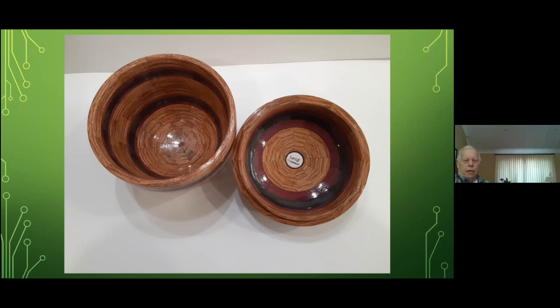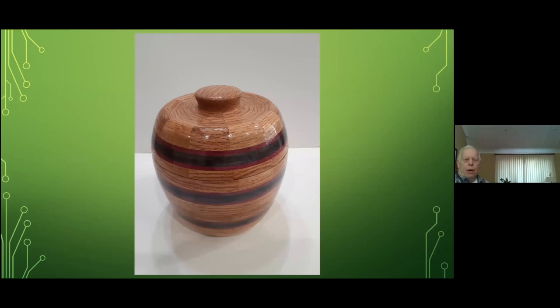And what everybody's talking about, the 13/16, it is a tight fit. So I take a parting tool and just enlarge it a touch to get the bead in. Then I take my Dremel tool and mess up the back of the bead, and I epoxy it in. I mean, who knows what these kids will do with it if they pop it. I sanded it down to 12,000, and I got 4 coats of wipe-on poly.